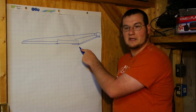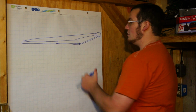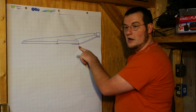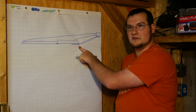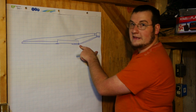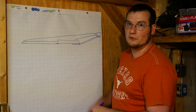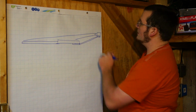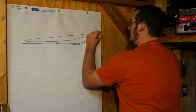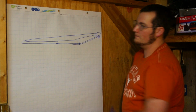I'm going to choose plexiglass, 1/4 inch plexi, because it's widely available and easy to machine. You can go with aluminum or steel. I would avoid steel as it rusts and is a lot harder to machine. Aluminum, make sure you get at least 3/16 inch. If you go any less, you'll probably get flexing when you move the guitar. As your camera mount, most cameras have a tripod mount, which is what we're going to use. And so there's going to be a screw right there that will just go up.